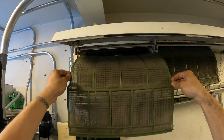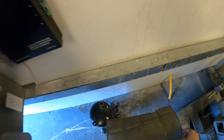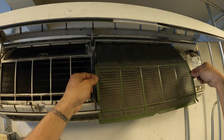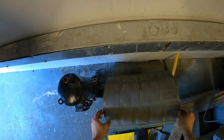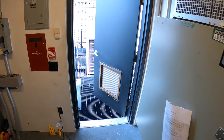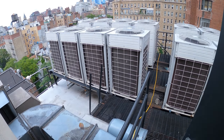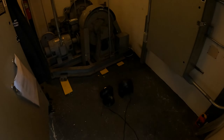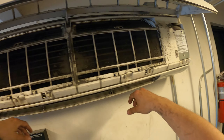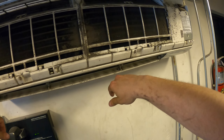These filters are absolutely insane. As soon as I pull this out I feel a huge airflow difference — yeah, moving a lot more air now. Wonder if that would do the trick. This is actually a compressor we just changed. This is the infamous LG building. Let's see if we get any better temperatures. Honestly it could be just a clogged filter.